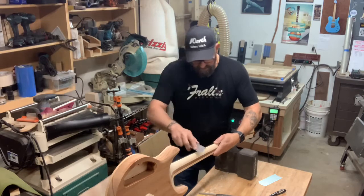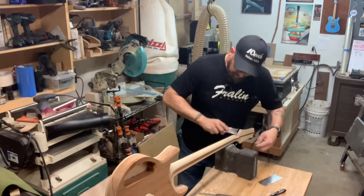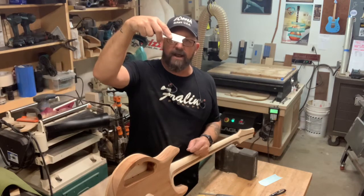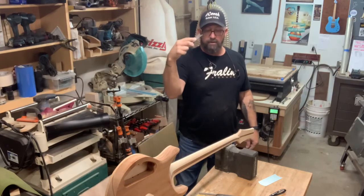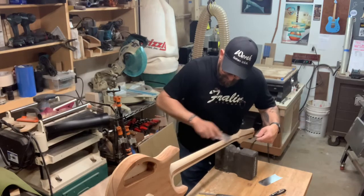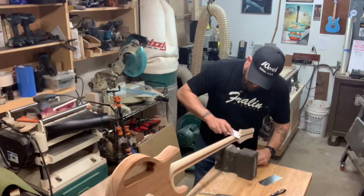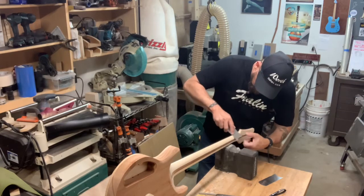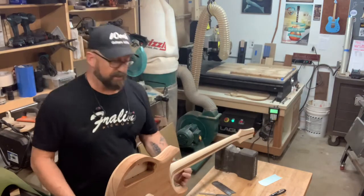There's still a small amount of shaping right there, a little flat spot. I take this scraper, start out at an angle, scraping, and then slowly turn it. So it's like you're going around, imagine going around a round rod. Slowly turning it while you're scraping it. And you get a nice, clean, round cut. Like that. Okay, that's good. I'll show you how this looks.